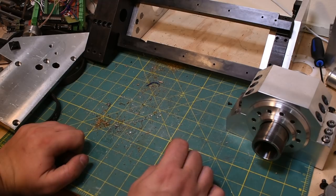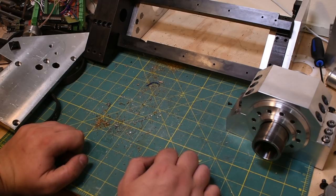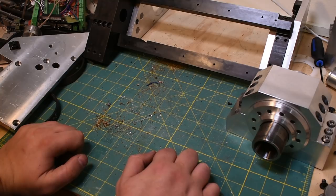Also, having a lathe without any kind of coolant is a pretty big disadvantage, considering aluminum is a fairly common thing to turn, especially at this level. Some kind of coolant would be great. The two tool turret thing was kind of cool, but I may switch it back to a single 8 position or 12 position turret and just have drills built in on that.